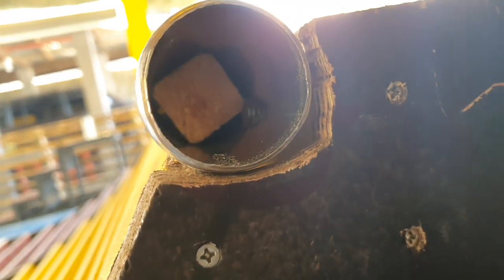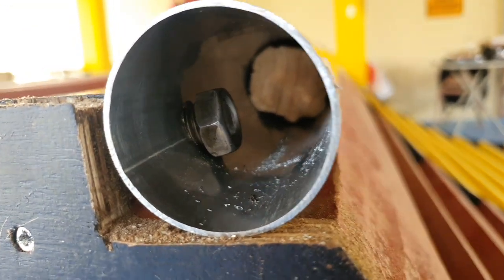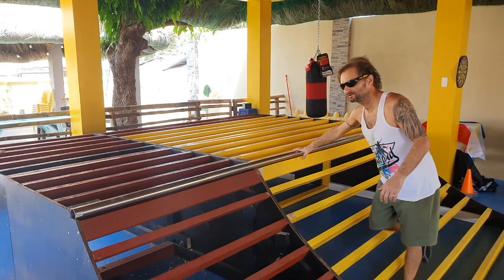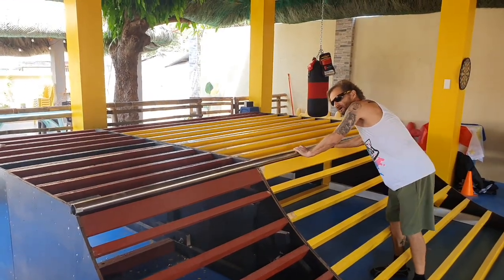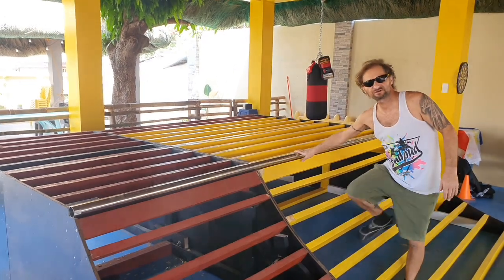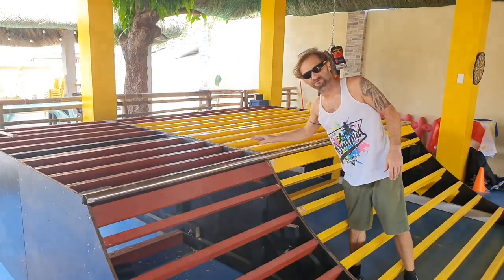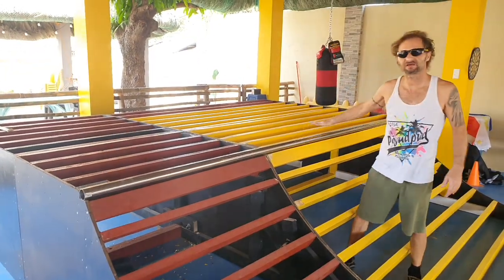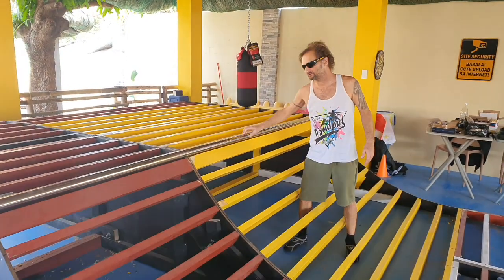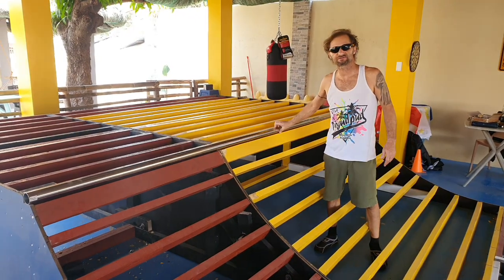We've got a connection. How about that? And there's our bolt. Just got to tighten it. All right, so we got 2 half-inch bolts on each side. It's totally solid. And we're just going to retrofit some of the first 2x4s to make it even stronger off the back. Especially when we put the deck on, this thing's not going anywhere. So this is really a breakthrough in ramp design.